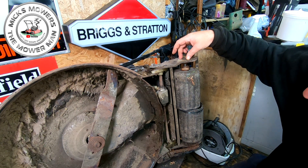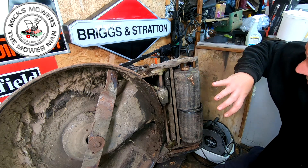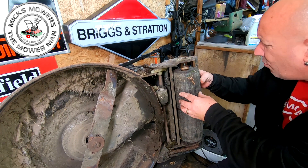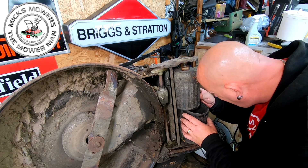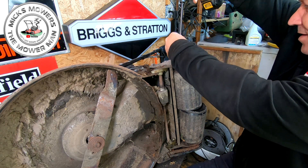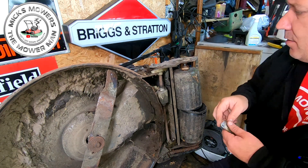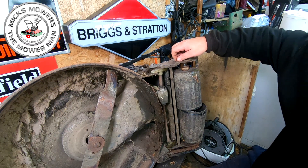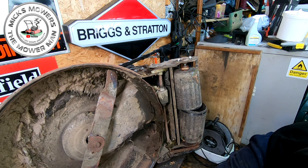But as you can see, all this has come adrift — I don't quite know why it's done that. Oh hang on, there's bits and pieces in there — that's all broken down in there. So let's remove that one — 10 mil there, 10 mil there — and that's got like a little tiny end keeper plate there. I'm going to put those little tiny 10 mil bolts back in just so I know what's going on. I think this has had catastrophic bearing failure, is what it looks like. There's a little tiny circlip on there too, which I dare say will hold the top of the bearings in.